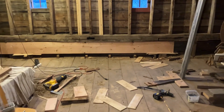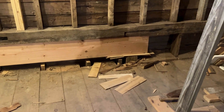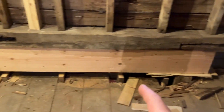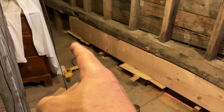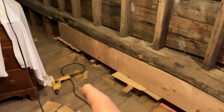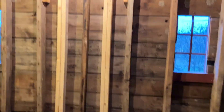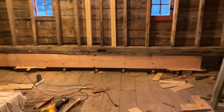I'm pretty excited to show you the finished product. Here is a three-ply 2x12 header and it's resting on that post and on that post and on that stud, and it's all tightly shimmed. During the time that I had to place the header, the span went all the way from there down to here and the beam held, and the wall didn't move at all. It's really great — on to the next project.